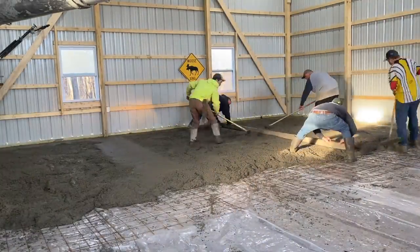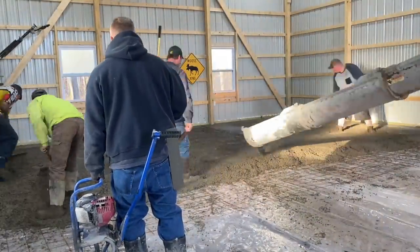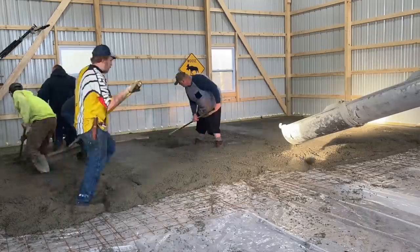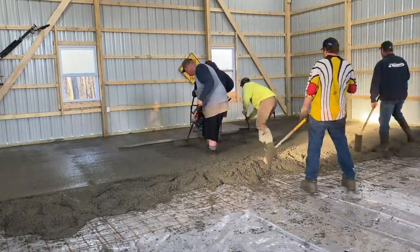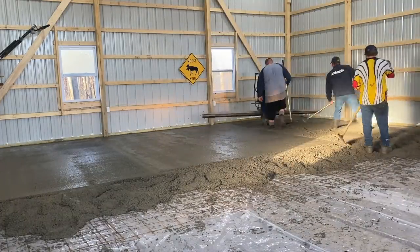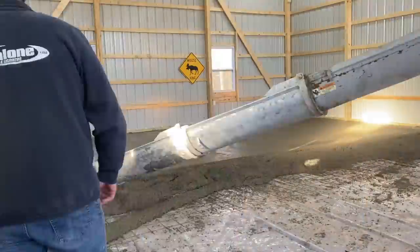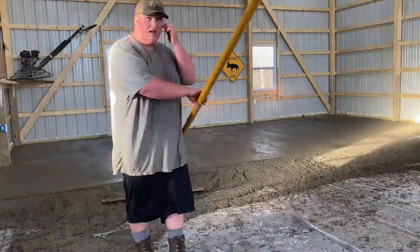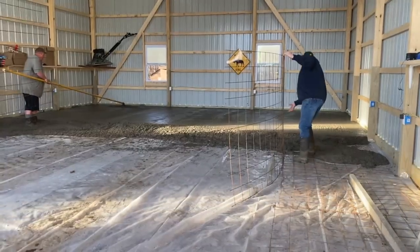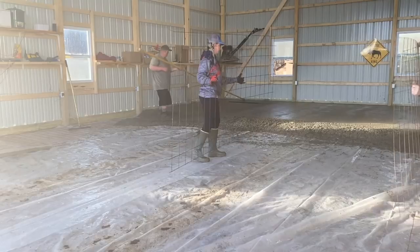And here we are putting in some wet pads, guys, just wet concrete set at grade. And then I'm going to come in here with my power screed and just knock it down like that. That's how we do it. And we're going to hit the middle, and then we're going to hit the other side. And then we got Big Biscuit going to come in here and float it. In a minute, he'll float that out right there. He's going to knock that down with the bull float. All right, now Big Biscuit's laying it down with the bull float.